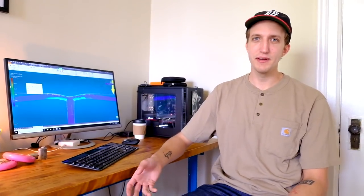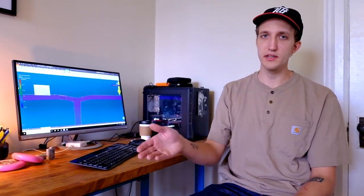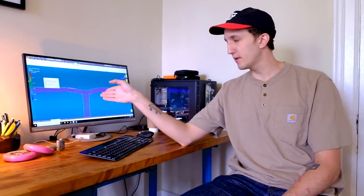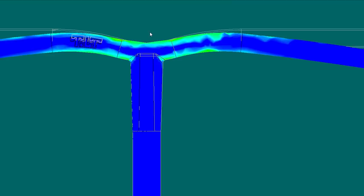The next style of bar that we make is the hybrid bar. It's kind of a blend of the scout bar and the century bar. There was a misconception when we came out with it that it was just for a certain look or style, but we always have to have a design purpose for the product. With the hybrid bar we wanted to improve on the scout bar — we saw the weakness was by the weld — and with the hybrid bar the shape of the crossbar actually removes that stress point. We tested over 40 different shapes doing the same process of stress analysis and came up with the strongest shape.